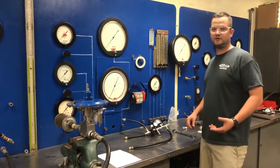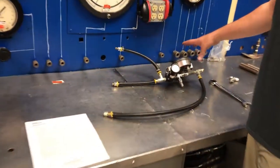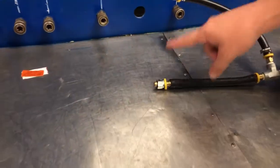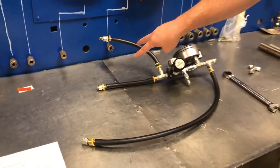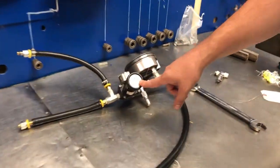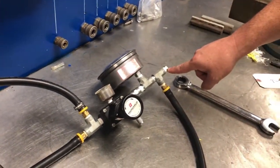We're going to show you how to assemble and use the VCI 1078 field test kit. The field test kit would be shipped to you pre-assembled and will look like this. It will have three hose ports: A, B, and C. Your A and B will be your inlet pressure lines; your C will be your sense line. You also have a regulator, a metering valve, a gauge, and an orifice.